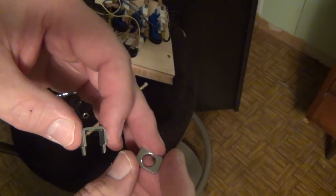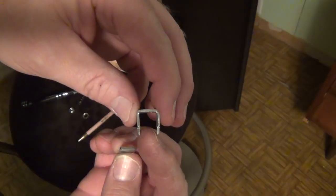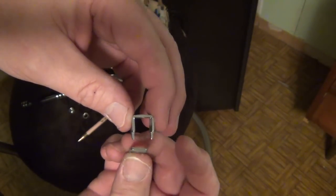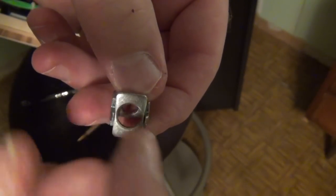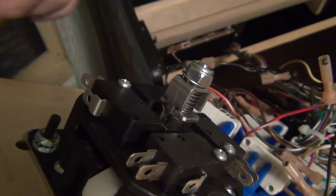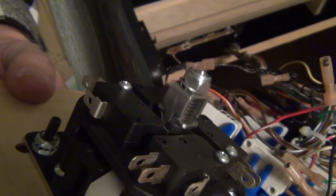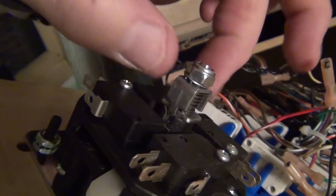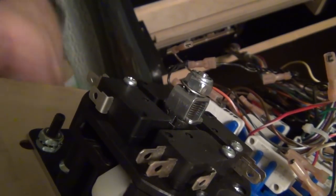There's also a little metal collar on the bottom that's supposed to slide up inside, but every time I was putting it on, it would spread these tangs all the way out to where they were catching the micro switch levers — because this collar is a little fat. So I'm going to gouge a little bit out of this spacer so that it quits spreading the tangs. A combination of beveling the tangs and narrowing each side of the spacer a little bit — now it slides up and down without spreading the tangs. Now it goes down smooth and doesn't grab the micro switch levers. That's a mod you probably have to make to this joystick.